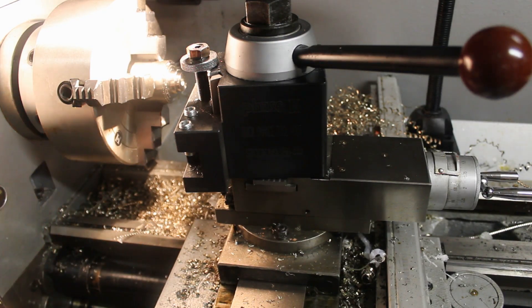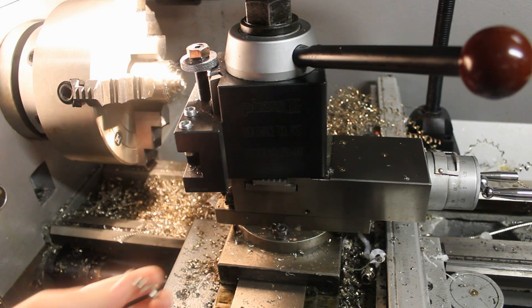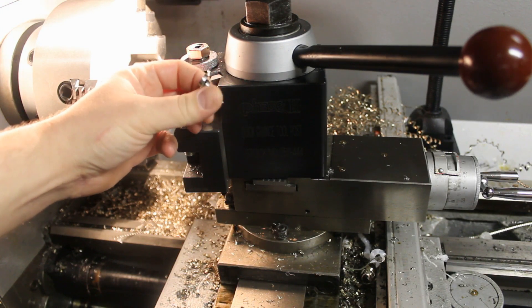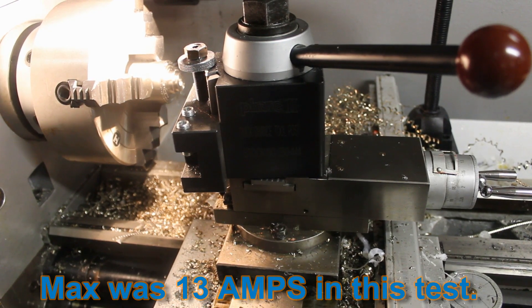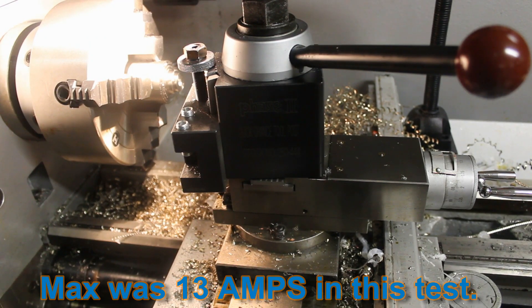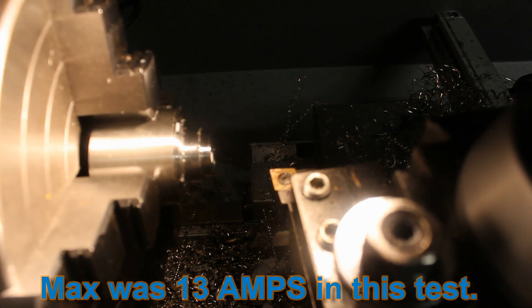This has to be tightened down really hard. I've had carpal tunnel surgery on both my wrists and I'm still recovering, so I can't put the necessary force on this by myself. But I hope that helps answer some questions. I couldn't watch the dial the whole time but I think it was up to about 16 amps. It probably would have gotten to 18 if not for the tool chattering — but I think that's the tool position and angle. I'm almost positive it's rubbing on the back side of the tool tip because of the angle.